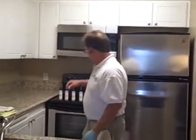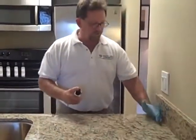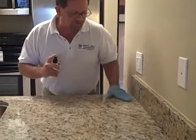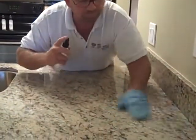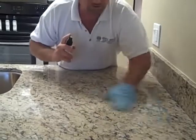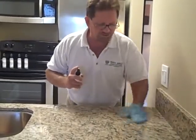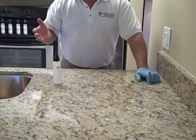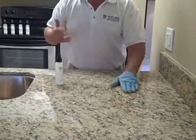So let's get started. This is a light colored granite, and for light colored granites we just start with number one. This is our technique: cup your hand to spray and you won't get any overspray. Put a little bit on your hand and rub it in — you can feel how far it'll go before you need to apply more. On a light colored stone it'll start to turn dark. With your gloved hand you can also feel any dirt, caulking, or epoxy left over from installation or everyday use.